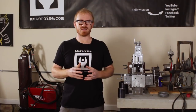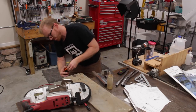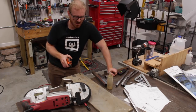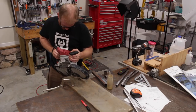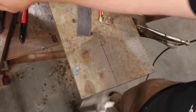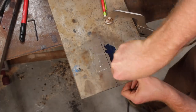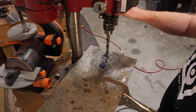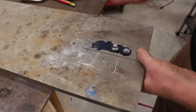At this point I realized I'd need a better way to cut it to the final length. This scrap yard find is about eight and a half by 28 inches long and probably three-eighths to half an inch thick stainless steel. I'm going to try to use it as a table for my portable bandsaw so I can cut this stuff more effectively to length. I cut into the half-inch sheet of stainless steel as far as the bandsaw would go, measured the throat plate and corresponding mounting holes, then dyed the plate, laid out the hole locations, and center-punched them.